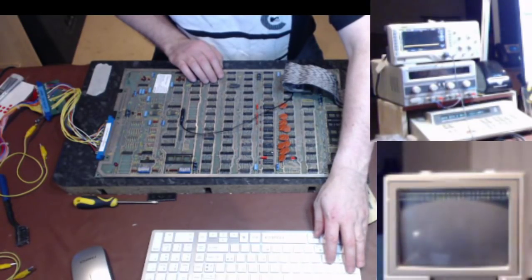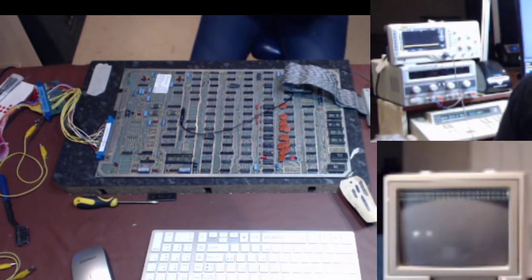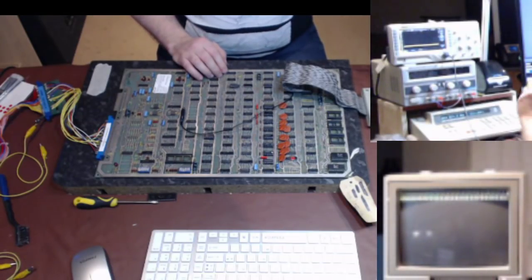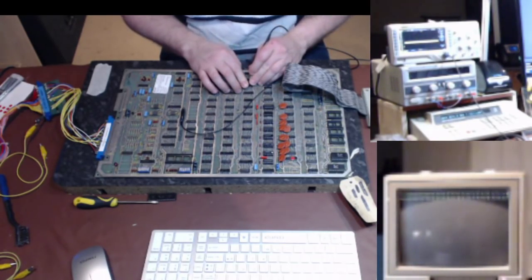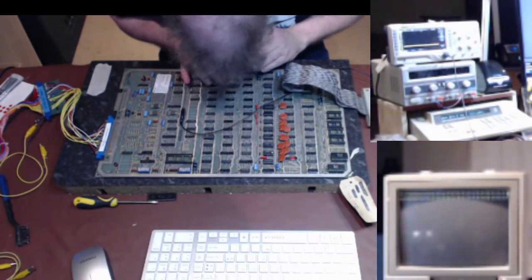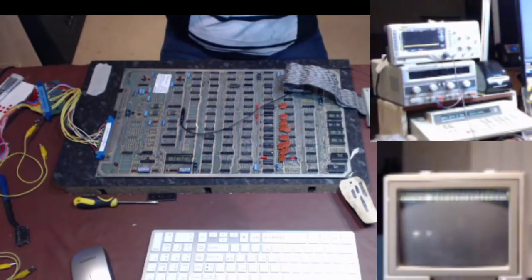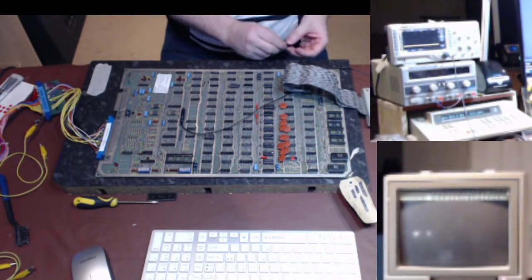So what is the chip? It's an LS00 and LS04. So the way we do this, we just grab an LS04 and LS00 for this. So 00, which is one of them. We put on C5. Do I now get signal on 13, 12, 11? 13, 12, still not really being pulled up, LS04. There's obviously some signal getting into it somewhere. Noise, basically, that's what it's amplifying. Is that an LS04? LS04, that'll do. I know it says H04, but to be honest, it won't matter in this particular application.